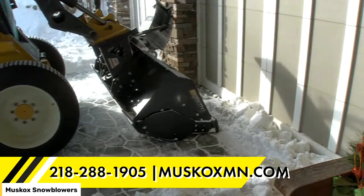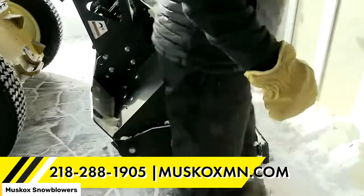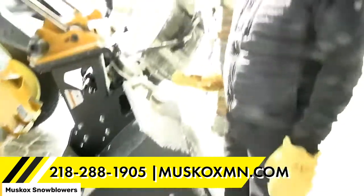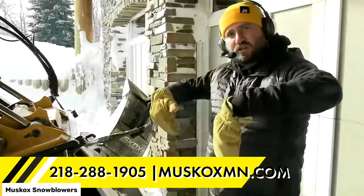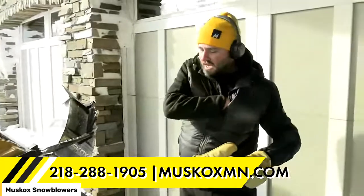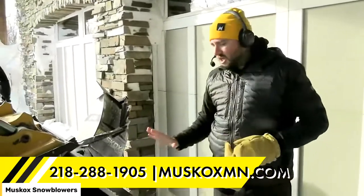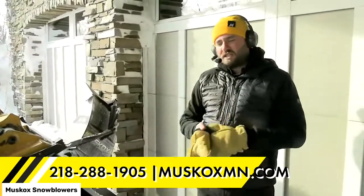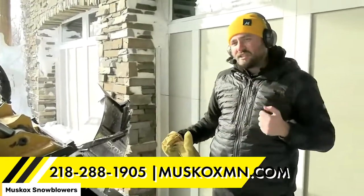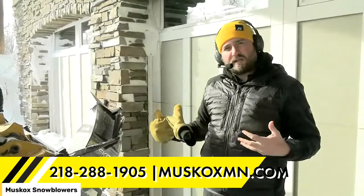And go ahead and stop there, Ron. Some operators, when they first get in this blower, naturally want to over-rotate when they get in this position, so they're getting too vertical with it. That's not the ideal position to be in for a few reasons. One, the visibility increases when you just lightly roll over the machine, but also being in this type of position creates more of a vacuum when you're back dragging and blowing out the snow.